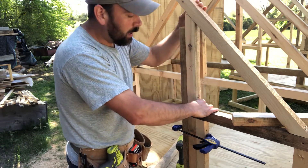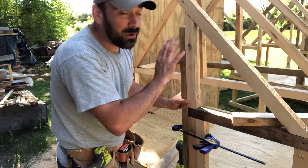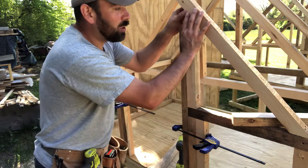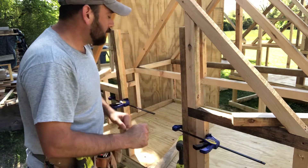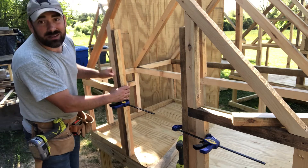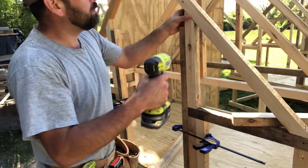The bottoms could be wiggly so I'm going to tack in a screw or two here to hold this in. I don't need to do a ton of screws because I'm going to put sheeting over this and that's going to hold and lock this all into place. And then the same thing on this side - fits like a glove. Let's drill some pilot holes.